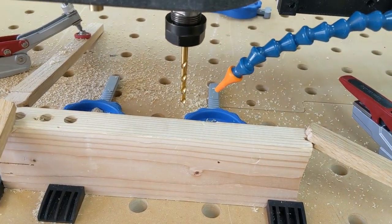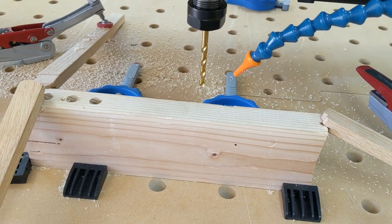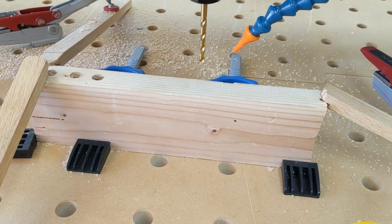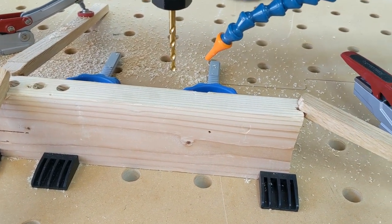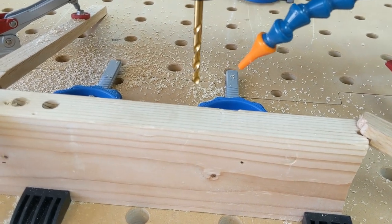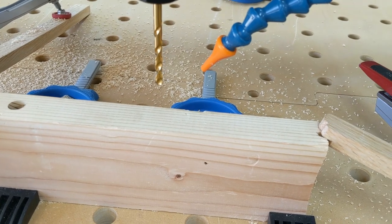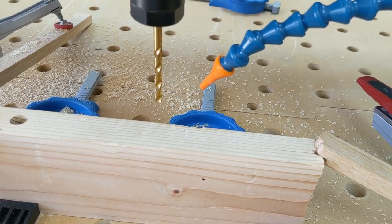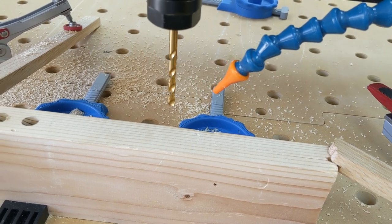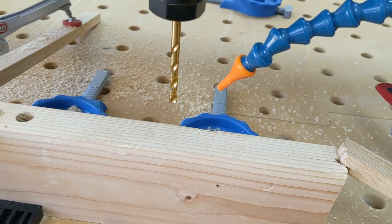Now I'm going to some smaller bits and running a little bit higher speed just to see if there are any issues. I should mention on the half inch bits I had a 20 inch per minute plunge rate, which was pretty slow but appropriate for that low speed and big bit. Now I've got a 7/16th bit in. I'm turning it up to 800 RPM because that's more appropriate for this diameter, and I went up to 30 inches per minute plunge rate. There's plenty of horsepower here for this and I don't think the tearout will be too bad.